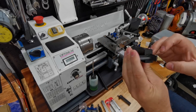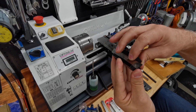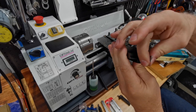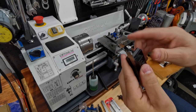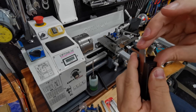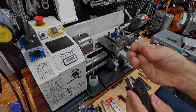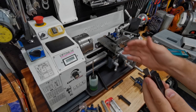This is the much more substantial version — it's a bigger piece of metal, much stronger, the holder is much beefier with two screws set further apart. The slot has angled cutouts so that as it's screwed down the blade is pulled tight against the face of the holder — absolutely rigid. The blade is also tapered to stop material binding and stop it overheating. You can cut your own cutting edge into it, and you might want to cut that edge on a slight angle so the piece you're parting off is the cleanest with the least burr, because it gets cut first and the burr mostly remains on the other side.